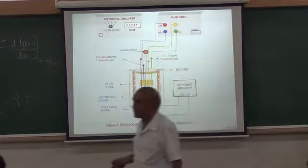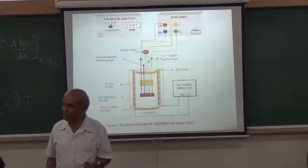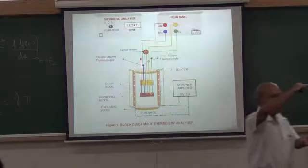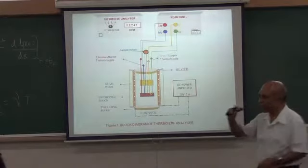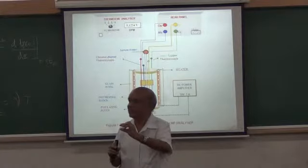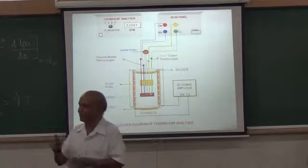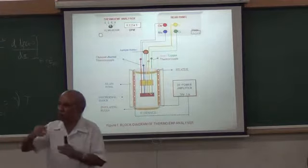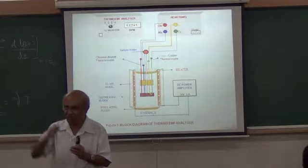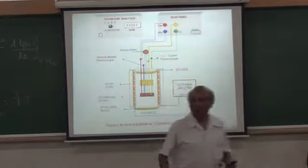So, yes, at the center part. At the center, in a furnace, it has got open ends, and there is what is called a constant temperature zone, which is close to the geometric center. Otherwise, a lot of techniques are there to improve this. We make one heater, and over and above that we put one more heater to compensate for the differences. We can do a lot of things. Anyway, this is a very simple thing.